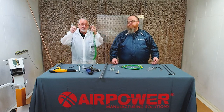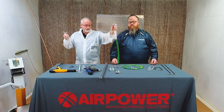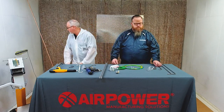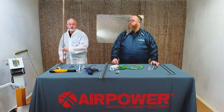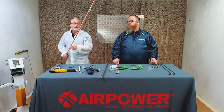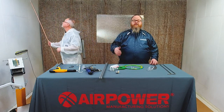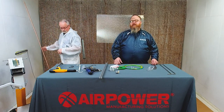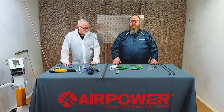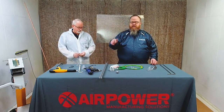But ground clamps are abundant. There's multiple of them. Get your ground to the rack and to the part, and don't lose the ground. Make sure that it goes to a true earth ground rod that's driven in the ground. Wet it out about once a week, pour a bottle of water down it. That way you maintain your ground, the earth doesn't dry up and pull away from it. And if you're watching this from a very arid area like Phoenix or the Southwest, you may need to take a lot more liquid down into your ground rod.